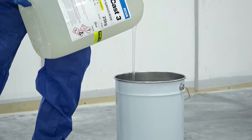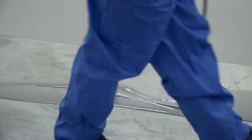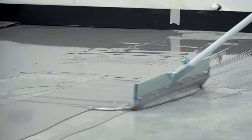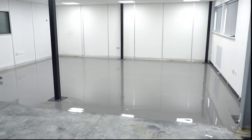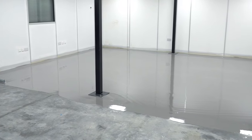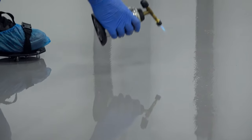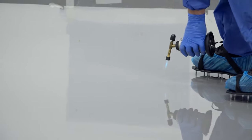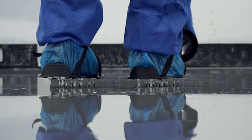It's then simply a case of repeating the process for each of the batches. It's important to complete the entire floor in one session, and for large floors with multiple batches it's very useful to have a second person for the mixing. For this 70 square meter floor, the entire process took 45 minutes with two people. GlassCast resin is self-degassing, meaning that the bubbles will burst on their own. However, we noticed a small spot where there were a lot of bubbles, possibly caused by an unsealed area of the floor, so just as a precaution we quickly flashed over this spot with a propane torch to burst them. If you need to cross an area that already has a resin coating, some spiked overshoes will allow you to do so without excessively disturbing the resin.